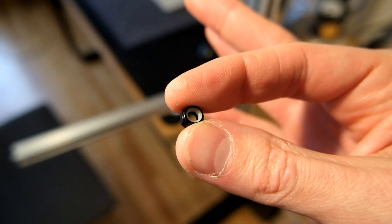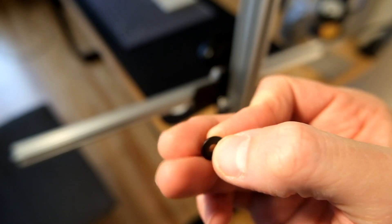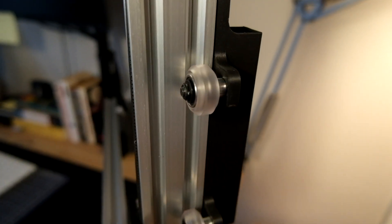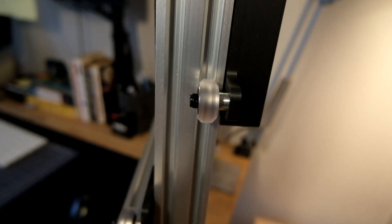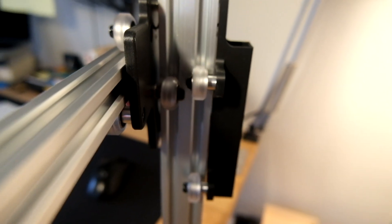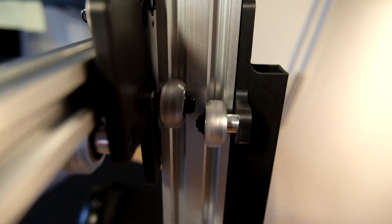I think what I need to do is go to the extreme and try out some of these guys, which are a super low profile nylock nut — I think they're actually made for drones to hold the rotors on. And if this doesn't work I'm going to have to redesign the part altogether. Now I have the super low profile nut on the top and then just the standard lower profile nut mounted on the bottom. Let's see if that worked. You heard that hit but that's actually just on the back side where I haven't changed anything. So let's get past that — there's still a little bit of rubbing right here. Let's see if the lower profile fixes it. Looks like it does — you can see they're just barely missing each other now.